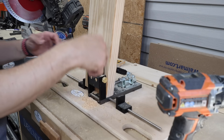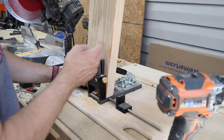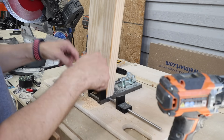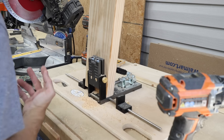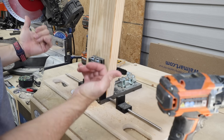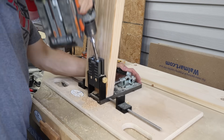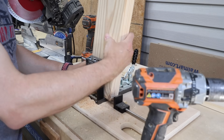I'm going to go ahead and drill some pocket holes in the top — this is actually turned upside down; this is the top of my back rail. I'm going to put one pocket hole here, one here, and that's to screw that top face piece on with. Some of them will have pocket holes on the bottom, a couple of them will, and the two end pieces won't have it on the bottom. I went ahead and sanded all these as well, just to make things easier.